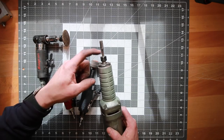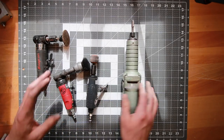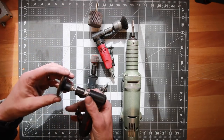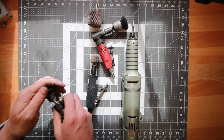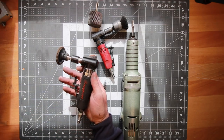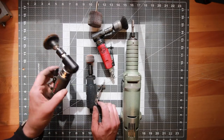Most of them are typically a quarter-inch shank — it's got a collet in there. These usually don't come with chucks, just a simple collet that takes a quarter-inch shank. But even with the quarter-inch you can get all different types of things like sanding drums, different types of wire wheels — this one here is a stainless wire wheel. You can also get flat grinding pads; this one here is a surface conditioning pad. I've got all different grits of sandpaper and these are very handy for metal prep work. A surface conditioning pad takes rust off really well. I actually use this a lot for taking the paint off the walls of my shipping container when I need to weld stuff to it. Auto body guys love these because they allow really fine intricate control when you're sanding stuff down, and for general metal fabrication these things are invaluable.